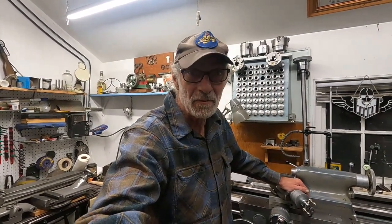Back here at the incredible Monarch 10EE, specifically the 1960 to 1983 module drive models, which had three vacuum tubes. One of the really neat things about it is it's single-phase, and you can run it on 220. You can actually, once you get one wired up, move it into your laundry room and run it off your dryer outlet. That's kind of unique for such a sophisticated machine for its time.